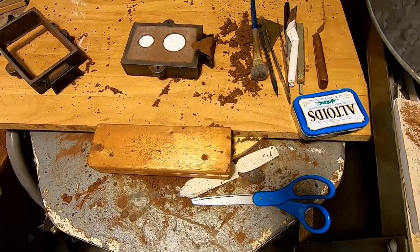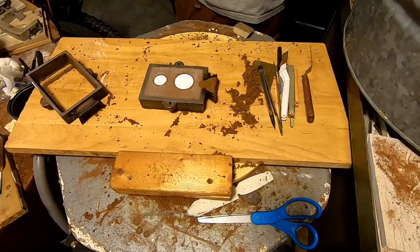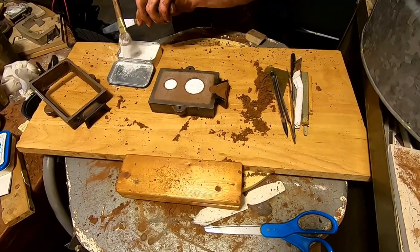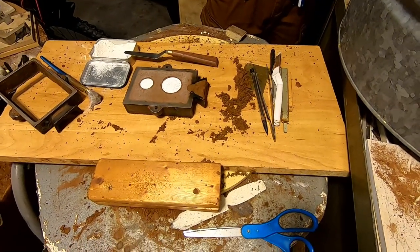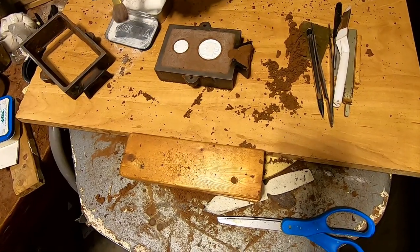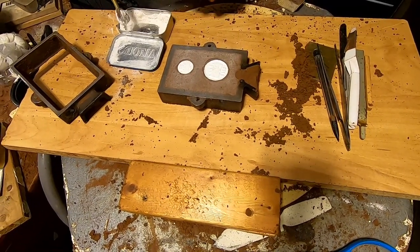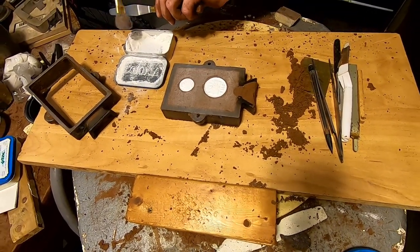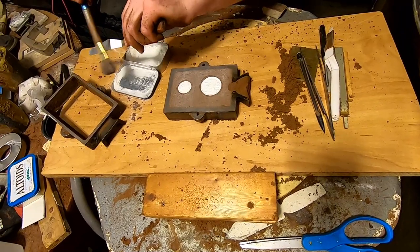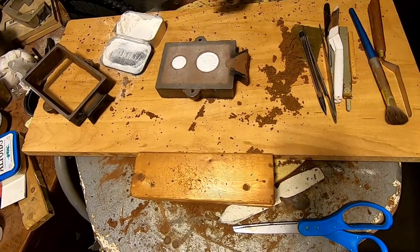Anything to save the mold and make it last longer. You can actually see it's darker around the pour spot from the metal hitting and reheating it constantly. This is the process you didn't see in the last video — him making the mold. Now he's going to put a separator on there to help separate the two halves, since he has to go back in and remove the plastic discs, and where those discs are is where the metal will be poured. You just want a thin coat — just enough to absorb some of the oil so the sand won't stick together.